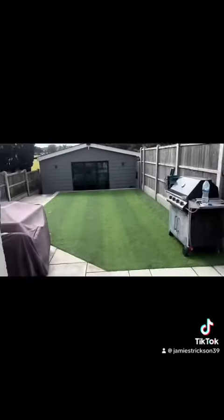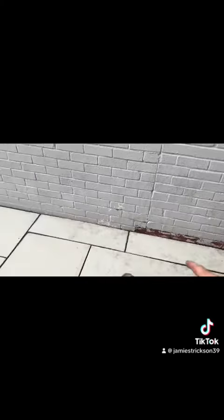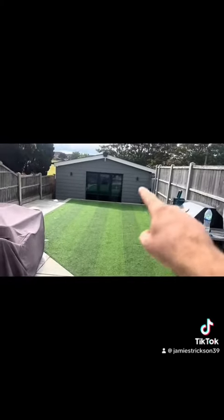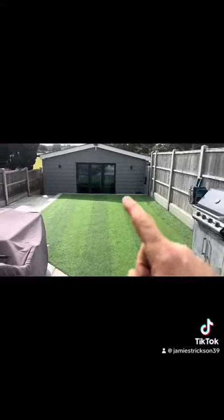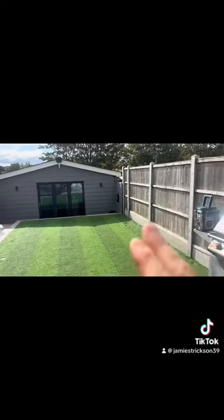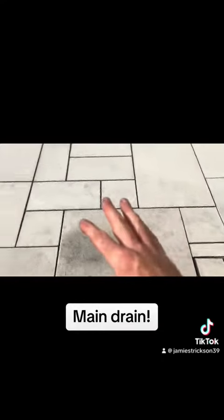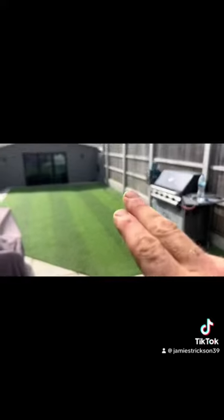The reason for me doing a light jet wash on this is because there is an inch and a half waste pipe coming out of the ground there, and that goes all the way down, comes out into the bar. I used it to run cables, but now I'm going to be putting a toilet and a shower down, and everything else - we need to pump that waste all the way over into this waste. So all of it's got to be done again, but I want to air test this - I want to make sure that this pipe underneath the ground is still good.